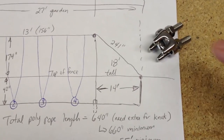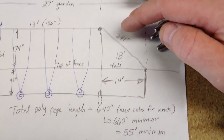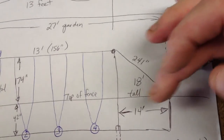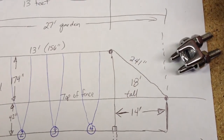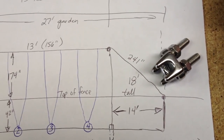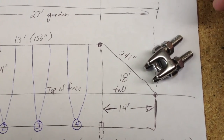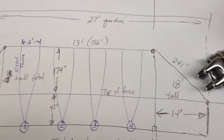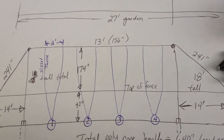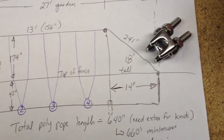The next step is taking these wire clamps and putting them on the rope. I did a little trigonometry to figure out the length — spanning 14 feet from the far right side pole, I'm going to need at least 241 inches of rope before I put on the first wire clamp. I'll give myself about 9 extra inches and call it 250 inches, then put the wire clamp there and feed it through the eyelet. After that, I'll measure another 13 feet from where I put the first clamp and put the second clamp on — that's the spacing between my two poles.